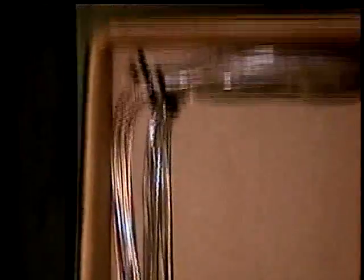This is the input side — eleven to one step-up on the transformer. In this particular case we need 20 turns and I'm using number 18 lamp cord. Smaller sizes may work okay, but may have a little bit of Johnson-Nyquist noise.